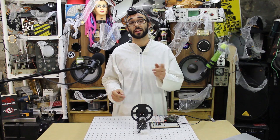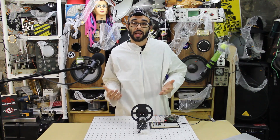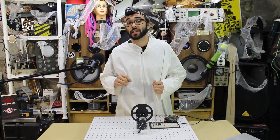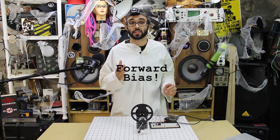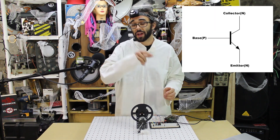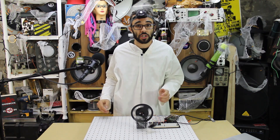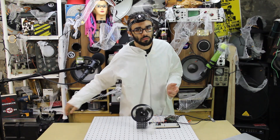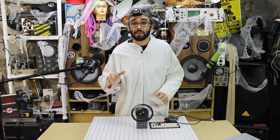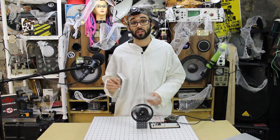Next, we have a relay driver circuit that will help power our DC motor. When an absence of light is detected, the Pi sends a logic high signal to the base of the transistor. The base-emitter junction will be forward biased, causing current to flow from base to emitter as well as from collector to emitter. With current flowing through the BJT, the cat toy motor will turn on. When an absence of light is detected a second time, the voltage applied to the base returns to logic low.